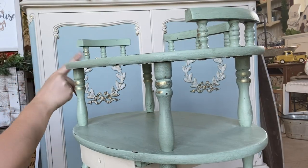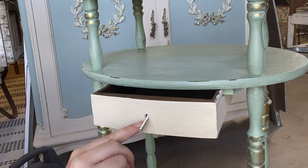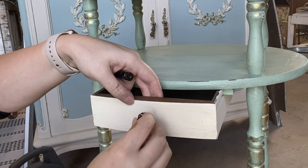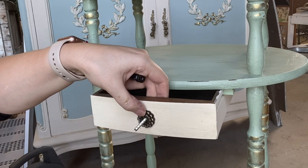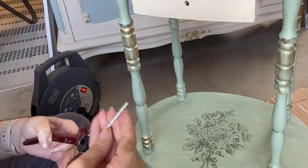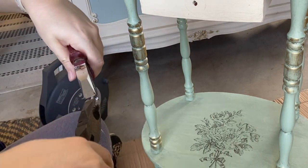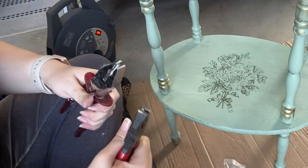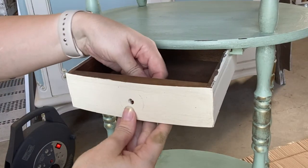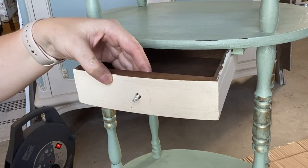To finish this off, I'm going to be adding a sweet little handle that I got at Bunnings, but first I need to trim the screw down to size. I've put it inside the drawer and I'm working out how much I need to cut off. You can count the different grooves on the screw as a guide to how much you should cut off. You then need to use two pairs of pliers — one to hold one side in place and the other to rock back and forth to break off the excess. Now that I have my screw the right size, I can attach my handle.